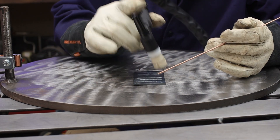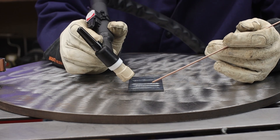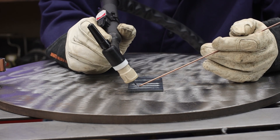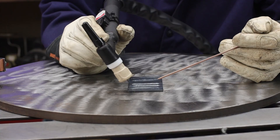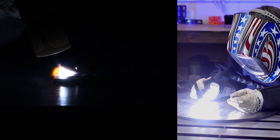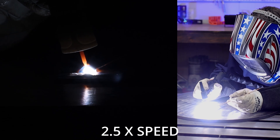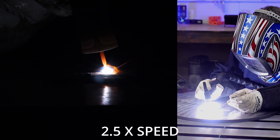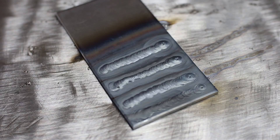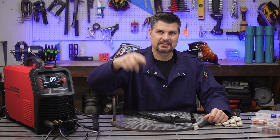We could spend hours on technique, but here are some tips to get you going. Go straight down at a 90, then clock it back 10 to 15 degrees. Being clocked back allows you to get your filler rod in there, and this is going to be a push style weld. Whether you're doing some curly cues, circles, or just keeping it as steady as possible, those are things you get to practice and work on to get better. The ArcCaptain — not sponsored — is a great introduction machine that has all of those settings included for a reasonable price. Go have fun TIG welding. I'm Mechmaster, we'll see you next time.